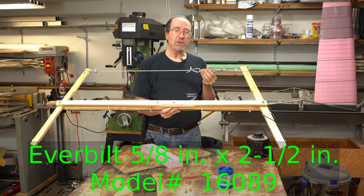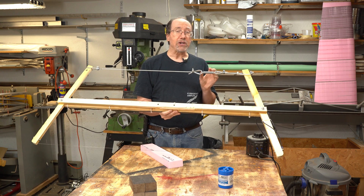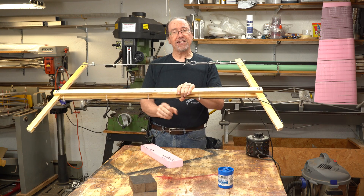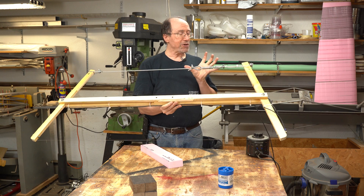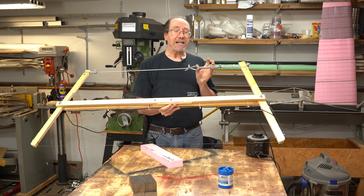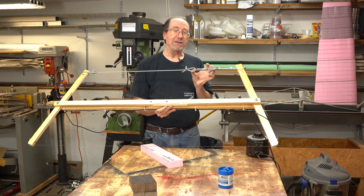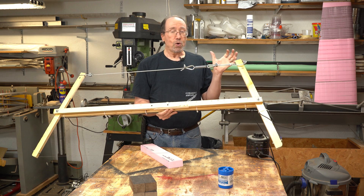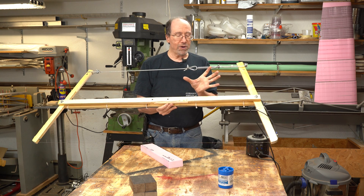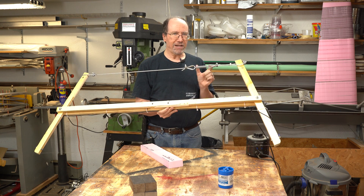The spring I chose can handle up to around 20 pounds of tension — at least that's what it says on the spec — so that'll work pretty good. Now it's not going to be a constant tension. As the hot wire gets hot it expands, which means the spring is going to contract up here and I'll have a little bit less tension on the spring. What I can do is heat up the hot wire and adjust the length of the spring — expand it out — so I have 15 pounds of tension. One consequence of that is once I cut the power, the hot wire shrinks down, which causes the spring to expand and there's going to be a bit more tension — not a lot, but there will certainly be more.